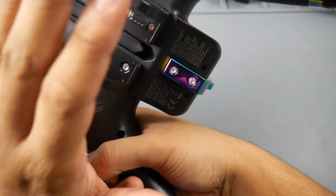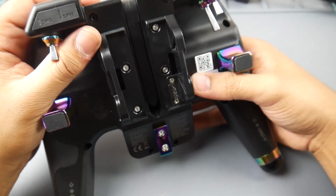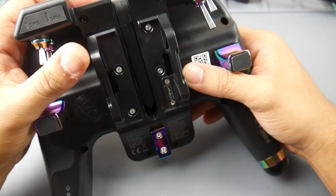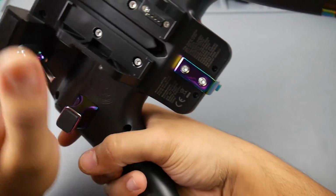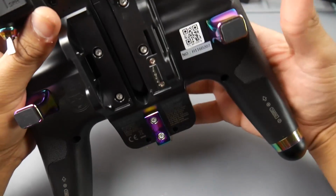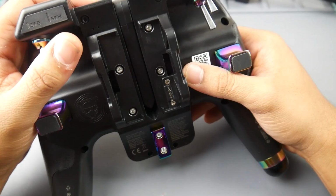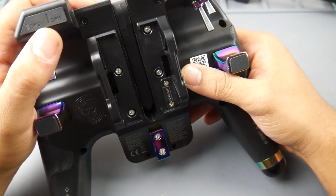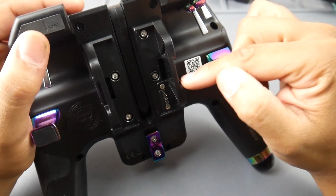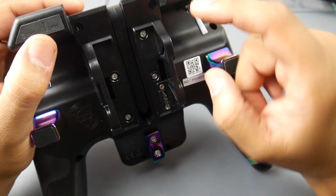I don't know what other bugs are in there just yet. Also, I do know one more. When you disable the external RF module, for example, if we put an R9 here, and you disable it inside the menu, it'll stay powered on. Now, I don't know if this is a software side, and I don't know if they've set up a circuit to actually turn off the regulator that's providing voltage out here, which can be a little issue and can possibly be unfixable.